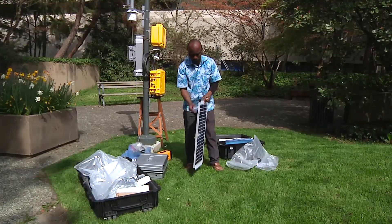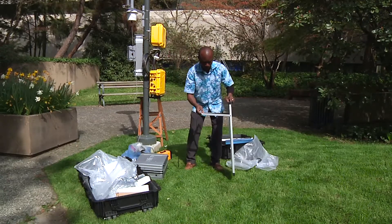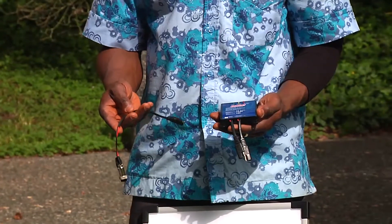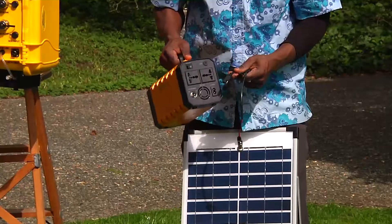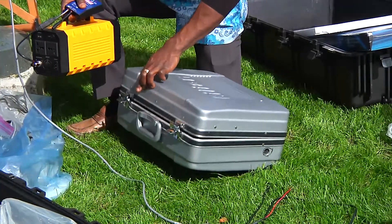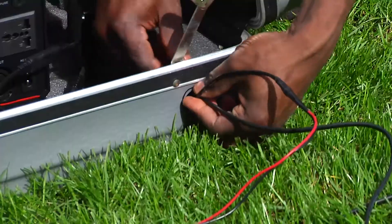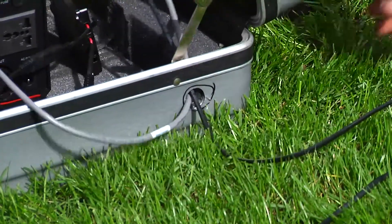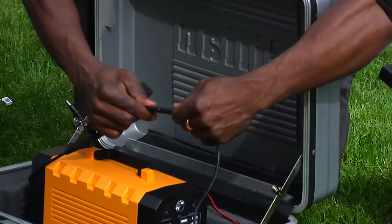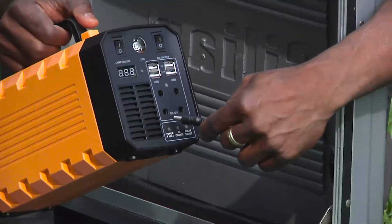To provide an uninterrupted power supply to the instruments, we have also provided a solar panel to charge the UPS, in addition to power from the grid. The charge controller has two cables: one going out to the solar panel and the other going out to the UPS battery. Keep all electrical systems and loose wires and cords secured in the box provided to shield them from the weather. Connect the solar panel to the input terminals of the charge controller, then connect the charge controller output to the UPS battery.